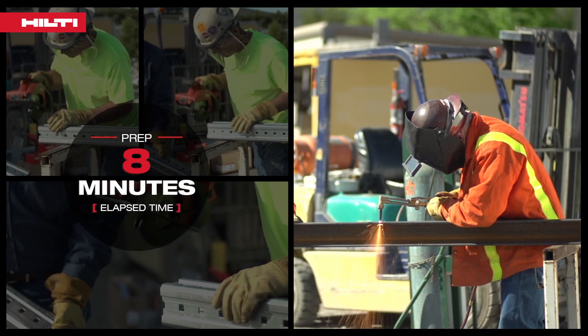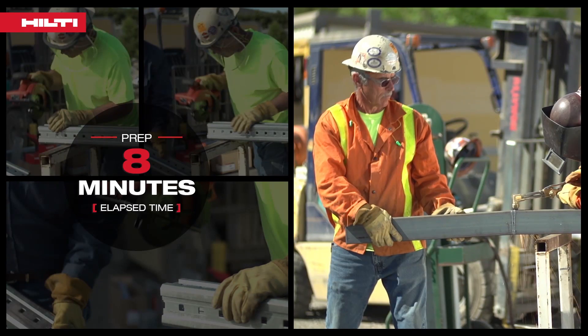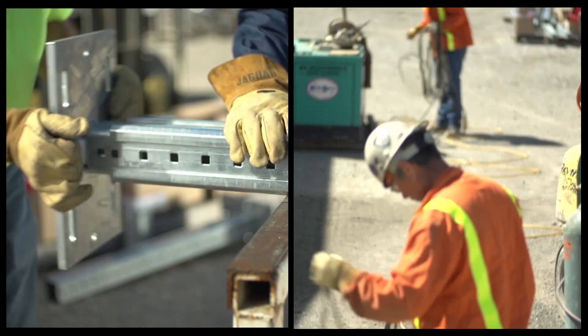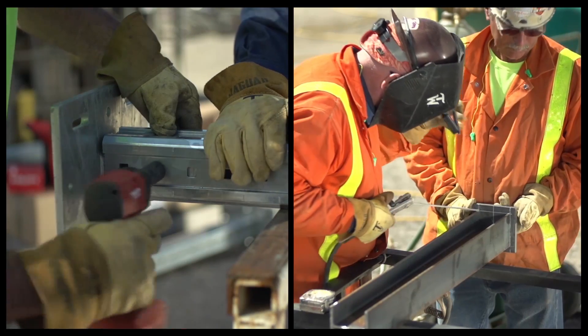Making preparation up to three times faster, Hilti MI girders can be cut quickly and easily and don't require any grinding, slag removal, or other finishing work. Components of the Hilti MI system are joined using a highly adjustable bolting system and can be quickly tightened using a battery-powered impact wrench.